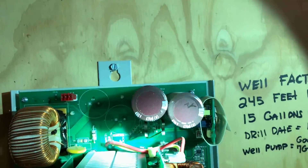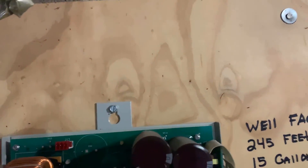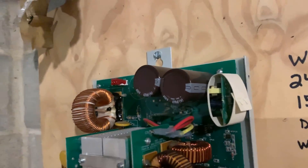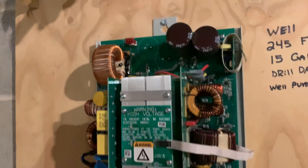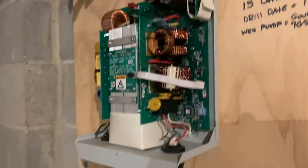I don't know if you're going to be able to see this — let me get my flashlight. I want to show you where this burn is. Take note, first and foremost: the capacitors will kill you, they'll mess you up pretty good. You've got to turn off the circuit breaker right away before touching this thing, and you want to wait at least 10 minutes before working on it, letting those capacitors de-charge before you start wrenching around with this box.